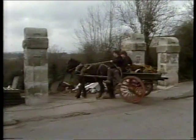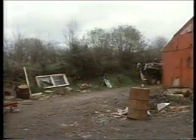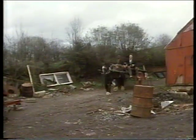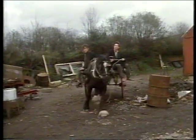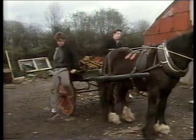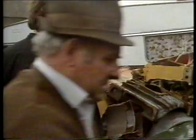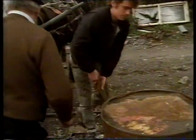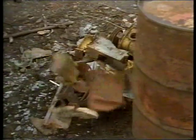We got a scrap from the Connors family who live over the road. My father is the one for looking after the scrap because he's been at the business a long time — he always has a keen eye for a good bit of scrap. We only use the best kind of scrap cast iron because we don't use any chemicals, so we have to pick and choose our scrap very carefully. If there's too much steel in the metal, it hardens the metal and makes it very brittle.